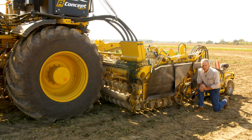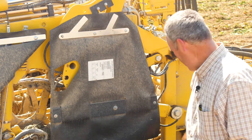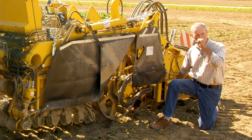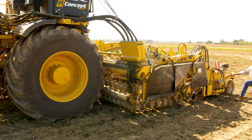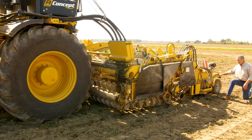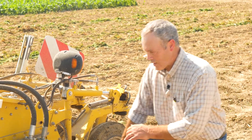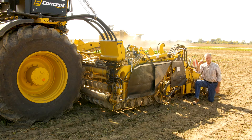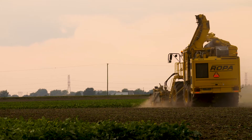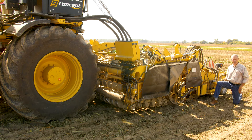That's first what goes through my mind when I enter a field — it doesn't take long. When you enter the field, you can see how high the beets are out of the ground from the window of the cab, and that determines how high I'm going to have my defoliator off the ground. That is achieved by the wheels up front with a hydraulic cylinder, also setting from zero to 20. So if the beets are, let's say, five or six inches out of the ground, I'll be around 10 to 12. From the cab, I will see the beets before it hits the scalper. I attempt to have stems left on the beets about three inches long. If you have variations in the field — usually on the knolls where the beets are a little thinner, a little higher on the ground — my rubber wheels would have to be lower so that the defoliator is higher.